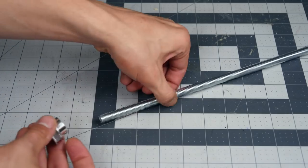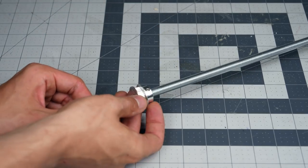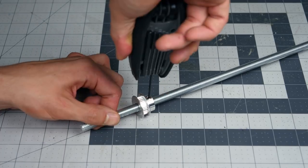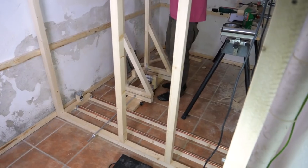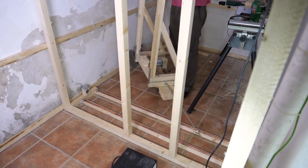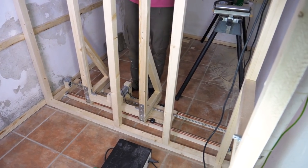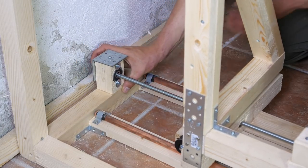Before putting the threaded rod through the cart and into the sockets, I made sure to attach the pulley wheel that we'll need later — I'll have the links in the description. To drive the threaded rod through the door I simply attached the end of it to my drill. Once it is through the entire cart, I can put it back on the rails, then attach the rail supports on the ends and fasten them using some steel brackets on the side.